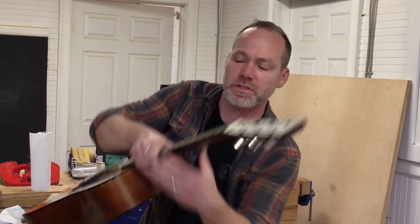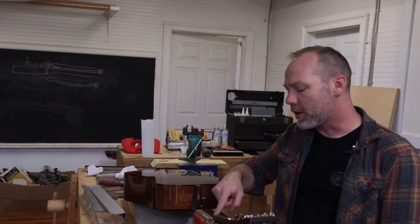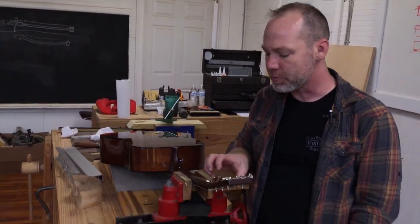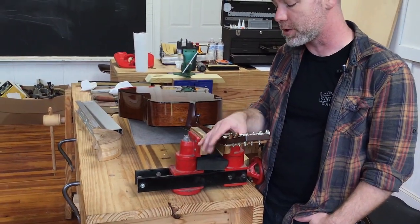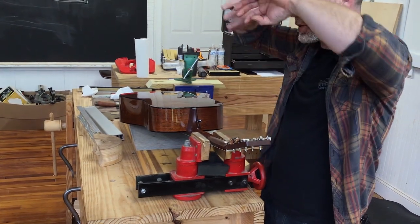It's like, wow, that's nice. If you see, I stopped repairing headstocks with splints. I just don't believe they do anything. If you get the first crack at it and everything goes, but I would get these headstocks, and for a while I would cut these two big arches on either side, fill those with wood, and then cleat. And that was a pretty repair because it looked like you had a butterfly on the back of your neck, or like two wings.